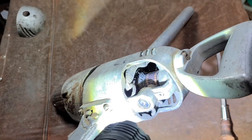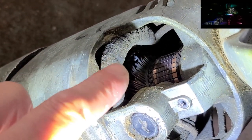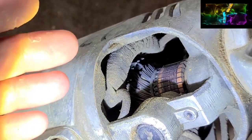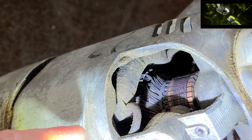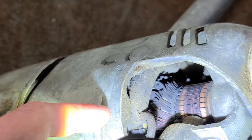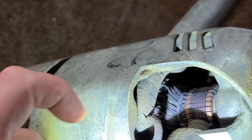This thing is probably 15 to 20 pounds — a little unwieldy, so it's a little harder to get into the camera. You can see where they've taken the field winding and wrapped it — something they just basically don't do on almost any power tool anymore. It's very rare to find. If you were to buy a Milwaukee or Bosch, it's very difficult — I think on Bosches it's only their really high-end like 600 rotary hammers that have wrappings around the fields. We can see welded contacts. This is a more classic motor winding where they have some wires that go in, then a piece of paper, then a separate layer of wires just to prevent them from abrading each other.